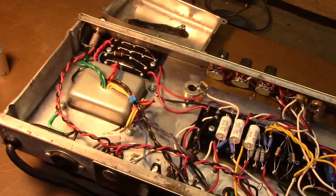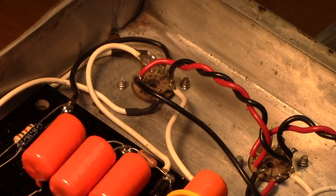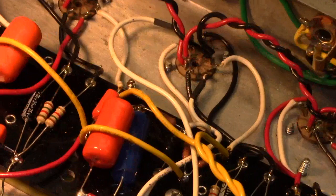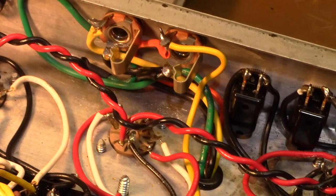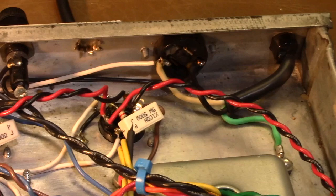Let's flip it around so you can see the tube sockets. There's V1 up there, and I've got shielded wires running to the first two triodes and also to that one because that's for the normal channel — the right-hand channel. Speaker jacks: we've got a 4-ohm and an 8-ohm separate speaker jack, because this output transformer came with two taps. So I wired them up in such a way that you have a separate jack for 4 and a separate jack for 8, which makes it much easier to run different speakers off this thing. Power tubes right there. Power cable, etc.